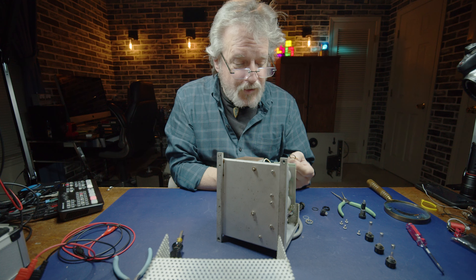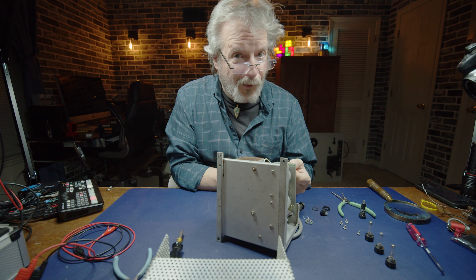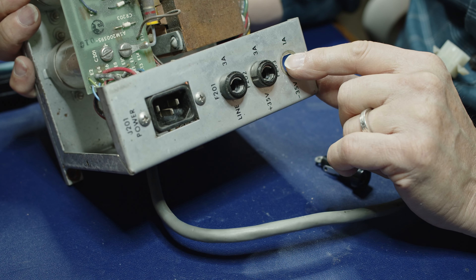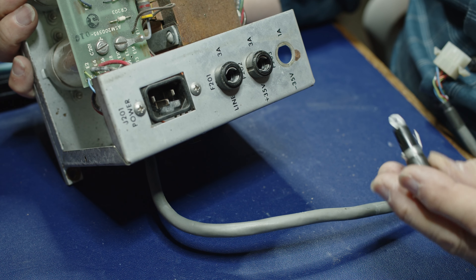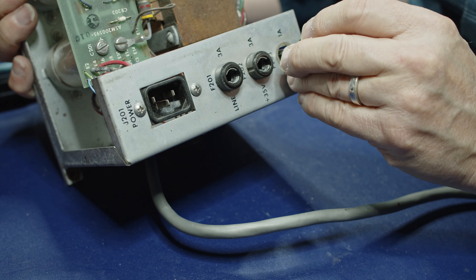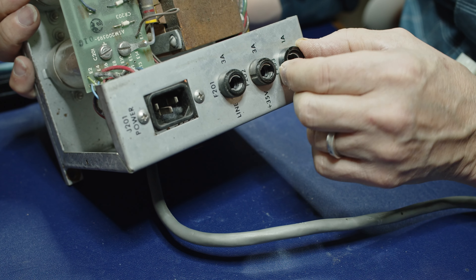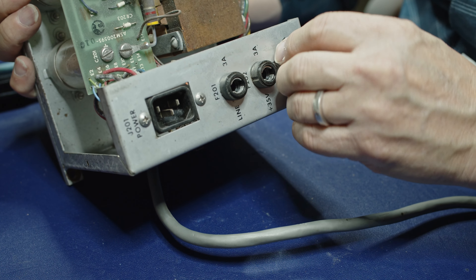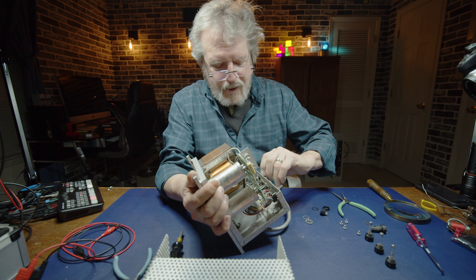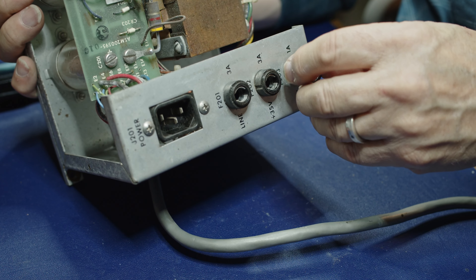There isn't a purist out there who's going to care whether or not the washer was original. We'll just put that one with that fuse holder. There's that flat spot I was talking about right up top there. With the new fuse holder you can feel where the threads are, so that's going to go in there like that. What happens now is that fuse holder is not going to want to turn - that just helps when you're twisting that cap off to replace the fuse. If it could rotate freely, these wires back here would get all tangled up and possibly short.